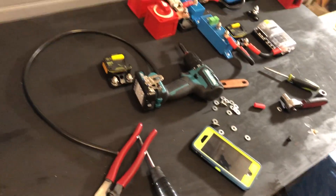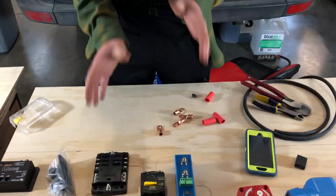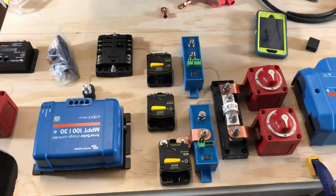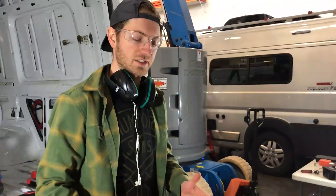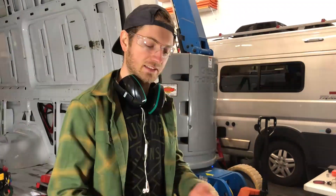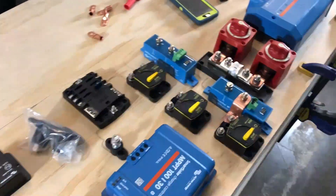It's looking good, made a lot of progress today. Basically we're laying out all our major components here — this is just our DC side of things, excluding all the AC we're going to do on the other side. This is about 45 minutes to an hour of our time just to lay it out, to make sure it all looks really nice and clean, that none of the cables are crossing over, and that everything has a direct flow from its source to where it needs to go. It's pretty much a Tetris game — you could do a million different orientations. What you want to do is ask: how do I keep cables from crossing over? How do I keep cables short to minimize voltage drop? And how do I make the board look nice and accessible to all the breakers and on-offs? These kits are expensive — they should be more than just power systems. They should be works of art, and if you take your time on it, you can make it a work of art.